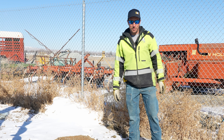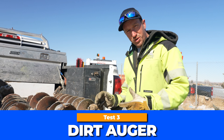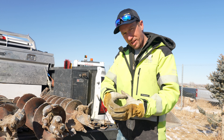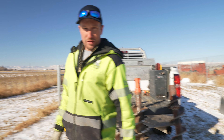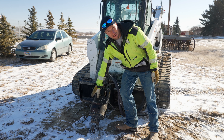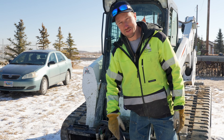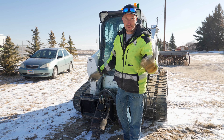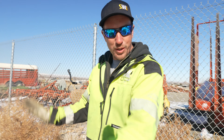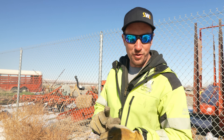This right here is the dirt auger. You'd use this one in good soil, but you can use it in rock too. If you're dealing with sand and rock together with rocks about that size, I'd still be looking for this one. The drive we're going to use today is Diga — this is our original very first Diga auger and it probably has about 10,000 holes on it or more, and it's been rebuilt just one time. We got parts for it, rebuilt it, and it's back in service. We're on the dirt auger with the plain teeth. He's going to drill one hole in low flow and another in high flow.